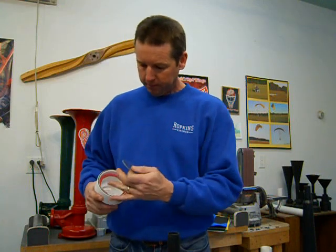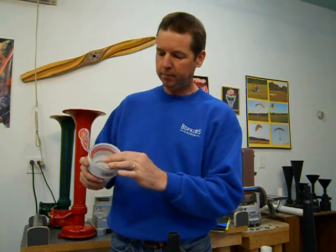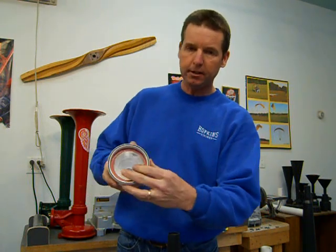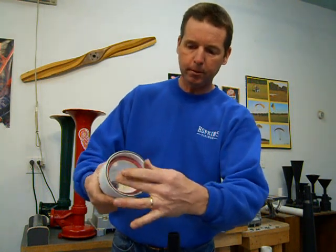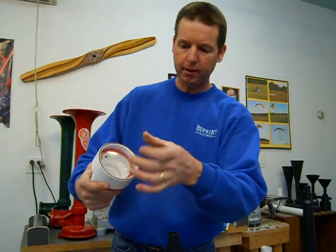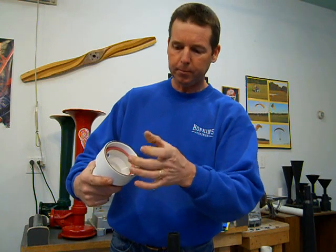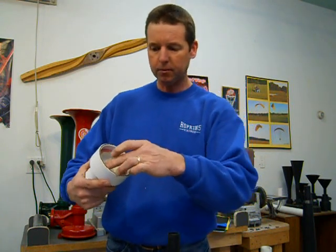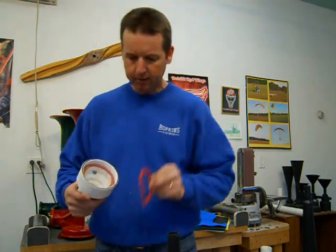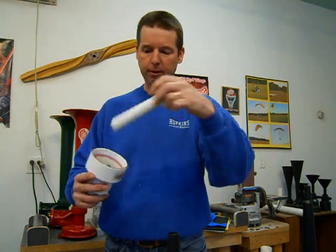So anyway, we got our gasket in there. Put in the polycarbonate. When I cut them, make sure that they aren't binding real tight against the outside edge of your power chamber. It should fit fairly close to the edge. You shouldn't have a big gap or anything there, but at the same time it should not be bound up and really having to force it to go in there. It should just drop right in and drop right out real easy. Got that in there. Now we would have already put our pipe and rear reducer, that'd already be inside there.